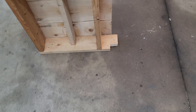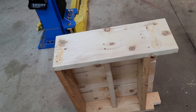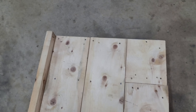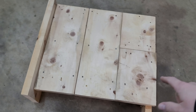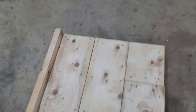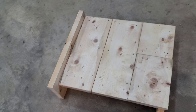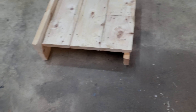That's the project. We're going to have to extend our airline a little bit and our power up to it — but that's no big deal. This is how it's going to sit on the wall: this part will be out towards the open air, and this part back here will be up against the wall in the back corner where the post is. I measured the cross bars and they're in the areas where the three feet of the air compressor are going to sit, so it's going to work out nice. It's very strong — I wood glued everything and it's got three-inch construction grade deck screws holding it together. It's solid. I could park a truck on this thing, so it's definitely going to hold the air compressor just fine.